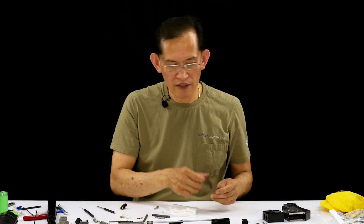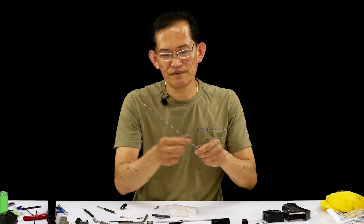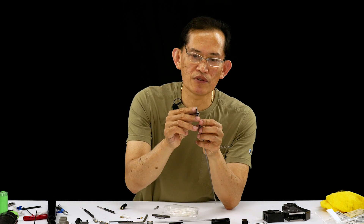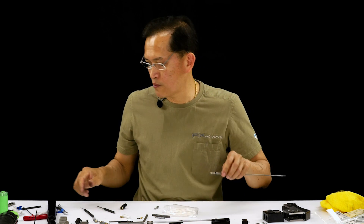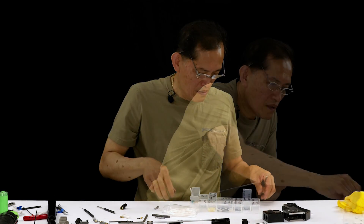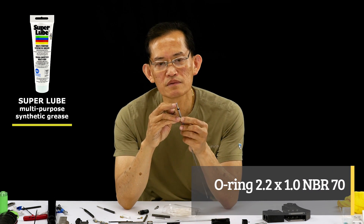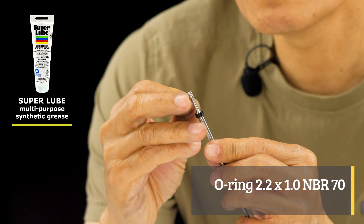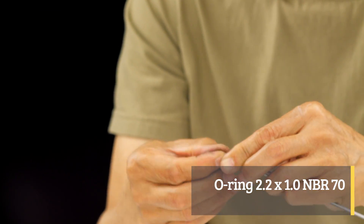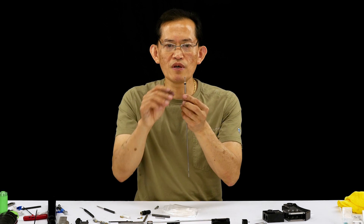Lightly lube your shaft rod. Now with a new one you might not have the 2x2x1 o-ring — we're going to install that. Lightly lube it. Even though it's brand new, inspect the o-ring groove, then slide it over.